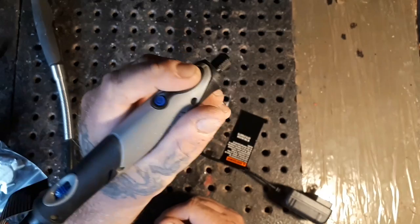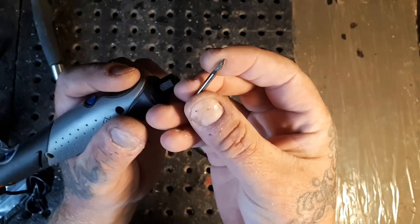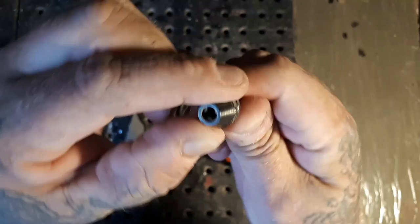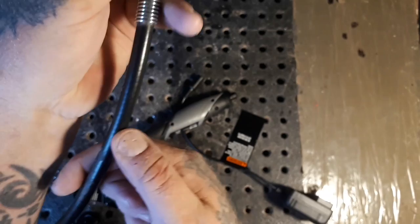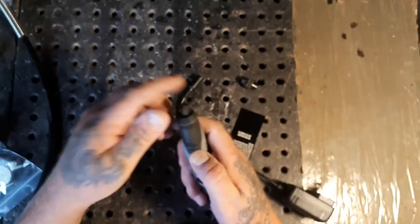It's comfortable - this is good for glass etching, or you put little tiny burrs in there to do fine detail. I'm not the best at fine detail because I don't have patience, but little burrs - even smaller like the ones they use for dentistry. On my flex shafts I use collets that don't need a tool and just twist on so you can change your bit quickly. I'm going to use the standard collet on this piece because the tool-free collets are more weight and more stress on the bearings and the flex shaft itself.